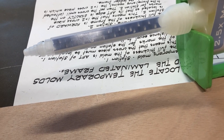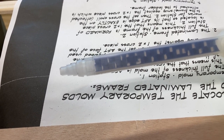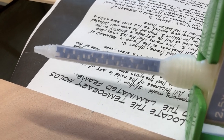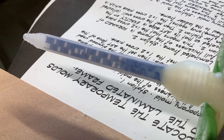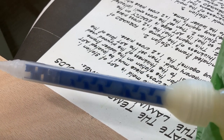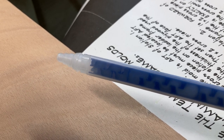When you squeeze the handle on this high-thrust caulk gun, it forces the resin and the hardener through the mixing tube out the tip. I probably should have cut the tip off one or two notches back so the resin comes out easier, but we'll see. The beauty of this high-thrust caulk gun compared to a regular one you'd buy at Home Depot or Lowe's is you can operate it one-handed — squeezing the handle with one thumb and two fingers.